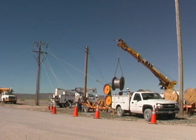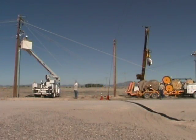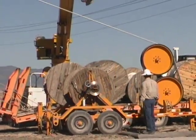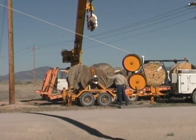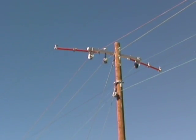This project is fairly complicated because we want to minimize the disruption of service to our members. We don't want to turn off their power. That means before we take out a section of the old line we have to bring power from another direction for that section so there are no power outages, or we have to perform the work hot, which means we have to work around the energized conductors.